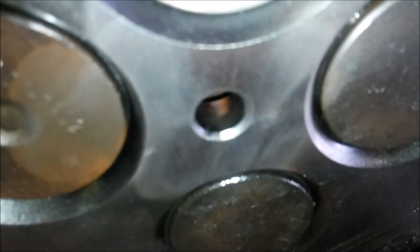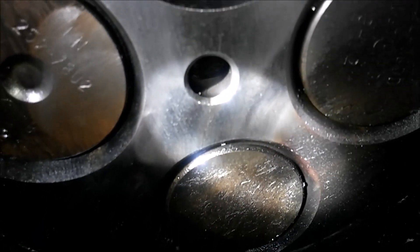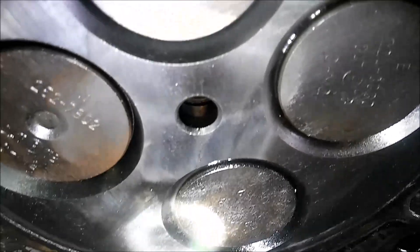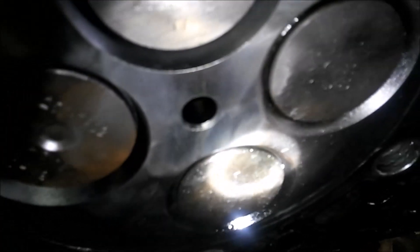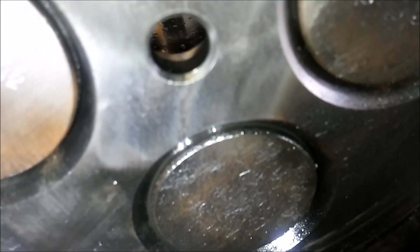Here's the cylinder head — this is the number two portion of the cylinder head. On C-13s there's a typical crack area, and that crack area is between the injector tip bore and one of the valves. This is an exhaust valve and that's the injector tip bore right in the middle. You can see there is a crack that goes between that valve and the injector bore. That's what you're looking for. The head gasket was okay, but the head was cracked, and this head is going to have to be replaced.